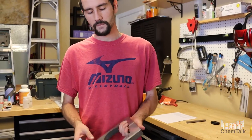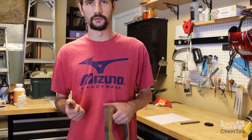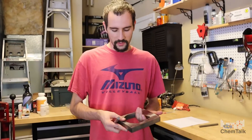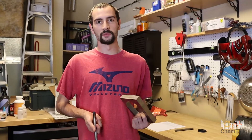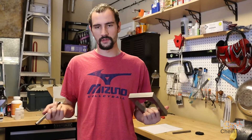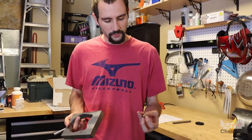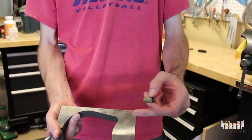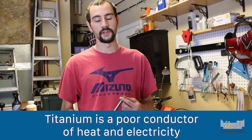Is titanium pretty strong on its own? Yeah, titanium is as strong as steel, but it weighs 45% lighter, so it makes it great for aircraft parts and stuff like that. So titanium is actually quite an interesting element. Titanium is one of the few elements that you can actually anodize without the use of a dye. You basically just apply a voltage to the titanium and you can get more colorful forms of titanium like this. And if you compare these two together, right here — different colors. So titanium in general is a pretty poor conductor of heat and electricity.